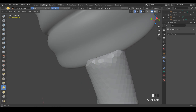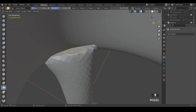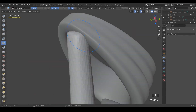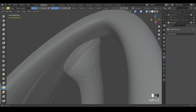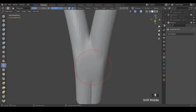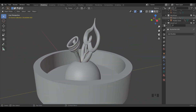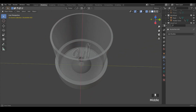Just like before, after I convert these pieces to a mesh, I'm going to go through with the sculpting tools and adjust where they're connected to the piece, just to make it easier for clean up. I don't want the sprues to connect to the face of where our decorative pattern is. Here are the finished pieces actually sitting in the rubber sprue base — this step isn't needed, but it's just a good representation of how I'm going to orient the pieces in the flask when I go to pour the investment.